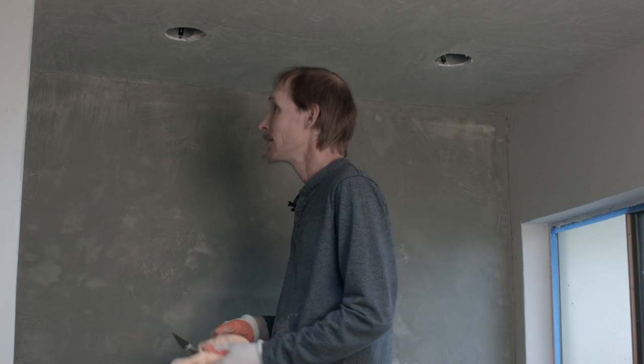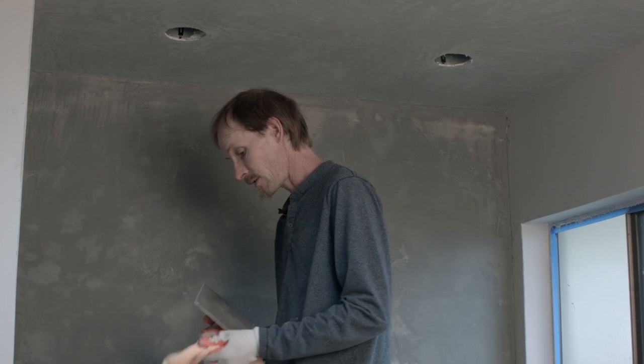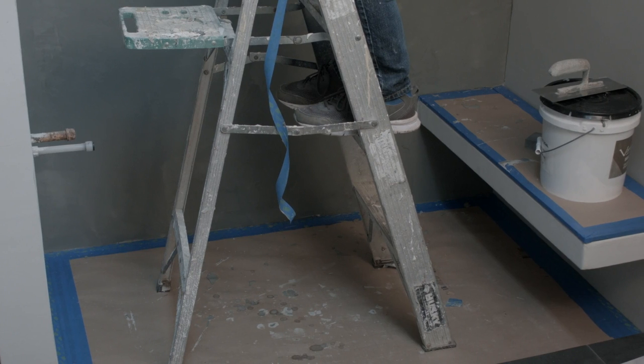I just pulled the tape off the ceiling. I like to tape off a finished edge so I don't get excess material on top or on an adjoining wall — it cleans off pretty easy when going finish to finish. Down at the bottom where I've taped off, I have two layers of tape. I have the initial tape that covers the floor and then an extra piece of tape around the perimeter. The floor paper is taped down about a quarter of an inch away from the wall and then I have a perimeter tape that goes about a sixteenth away from the wall. When I do my final troweling I'll peel off that last piece of tape but still have my floor covered.